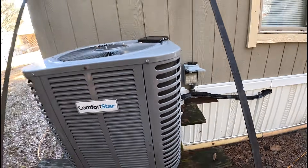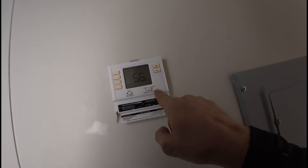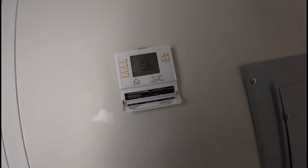It is straight cool. You can tell by the options right here — with emergency heat, heat, off, and cool — that this is a dedicated heat pump thermostat.